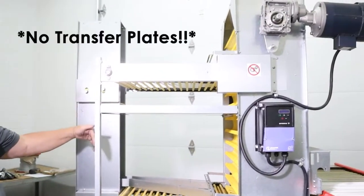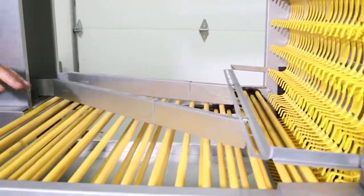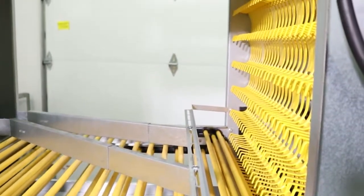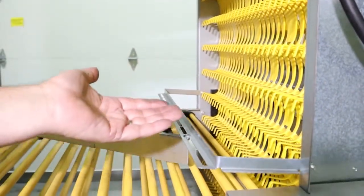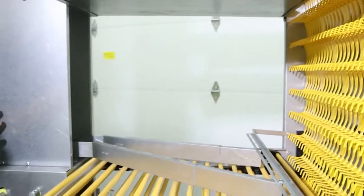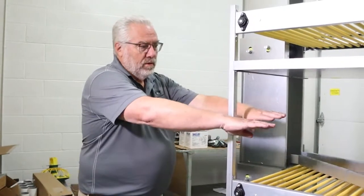The collector is well recognized as the best in the industry. It has no transfer plates from the belt coming into the rods, and no transfer plates from the rods to the fingers. It has a rod specifically designed so that if a wrench comes up and jams into the fingers, the rod breaks — not the fingers. The fingers are very well built. Eggs coming in on the rods can be directed to either every level or every other level, so if you have a wide belt, you don't need to push eggs back and forth — you simply let them flow straight to the collector.